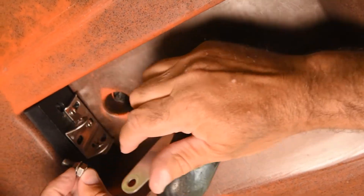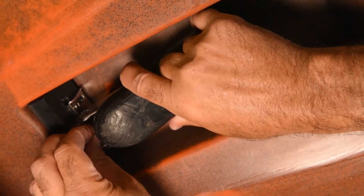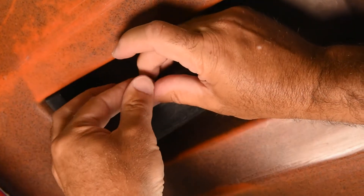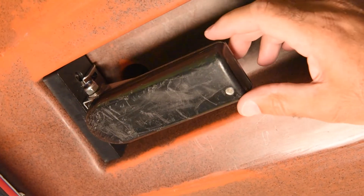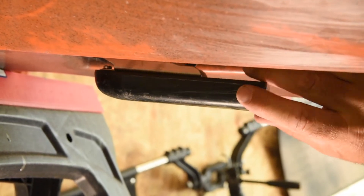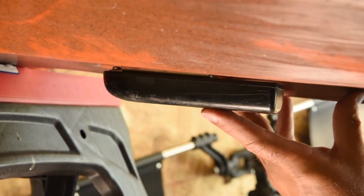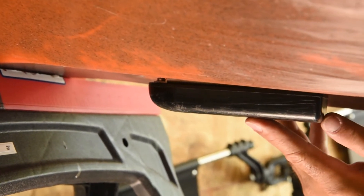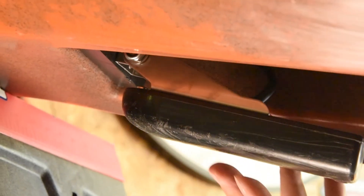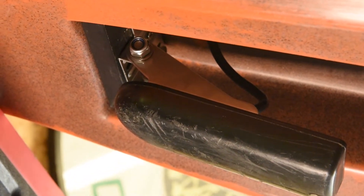Take one bolt and one nut on each side — it's a little tricky working underneath, but put your washer on and then your nut. Once you've got your two bolts and nuts in, go ahead and tighten those up. Make sure, especially if you have side imaging, that your transducer is hanging down past the side of the kayak because it needs to send out signal for side images on both sides. If it's tucked all the way up, it'll just hit the side of the kayak. The transducer stays pretty safe under there since it's tucked behind the bow, but it will get a little beat up — that's just part of the game. Level it and get it tightened up.